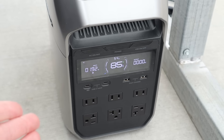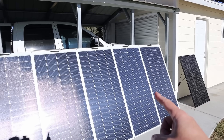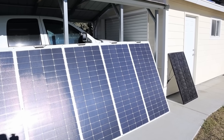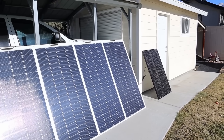I've unplugged the standard 200 watt panel and connected in the Shadow Flux 200 panel. We are getting 193 to 192 watts, so a little bit more power from that newer panel. It's worth mentioning that these Renogy 200 watt panels are over a year old and have been outdoors every single day — they're still putting out good power and the ETFE coating is still holding up strong.